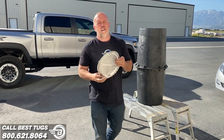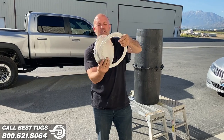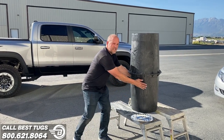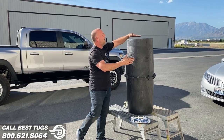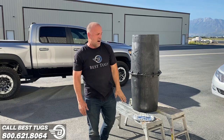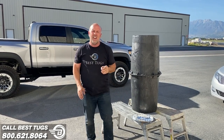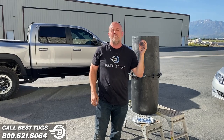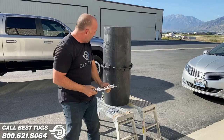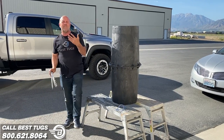What we're doing now, we're doing a fuel door, inspection door, service door test. Currently, half the screws are in here. This is full all the way to the top. The reason I did that is I wanted to cause a volume head pressure that is high enough to exceed by 150% of what the max pressure that will occur inside the wing is. So far, woohoo! There's not a drop, bone dry on my hands.